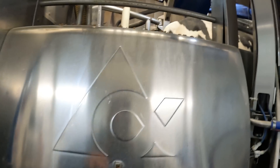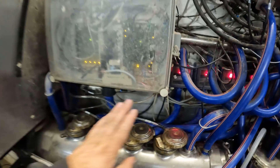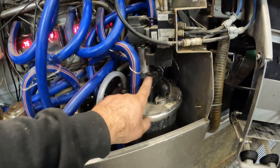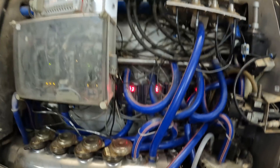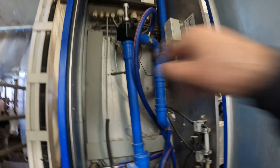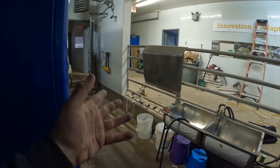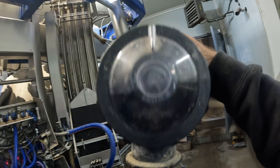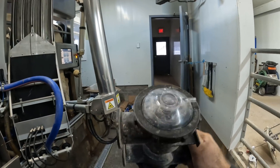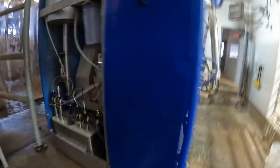I'm going to take you over here and pop this cover off. These all still use vacuum — these are the actual shutoffs that tell each quarter to work. But this block was updated. We had already previously updated the actual teat cleaner plunger, so this canister holds the wash water from cleaning the teats. Updated all these valves down in here, updated this drain valve, updated the top valve. The biggest valves we had issues with were the wash valves — that top plate cover — and those black diverter valves used to be right here. As you can see, there's water in them — water builds up inside and escapes past it.